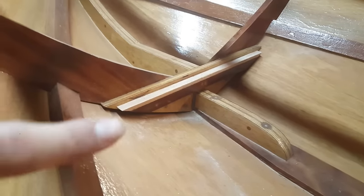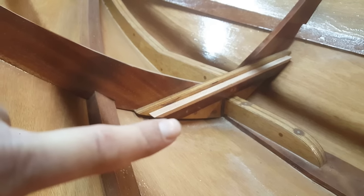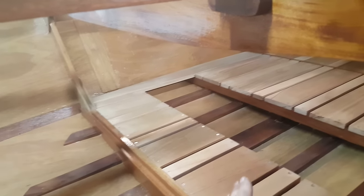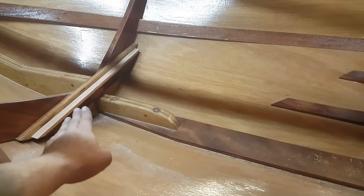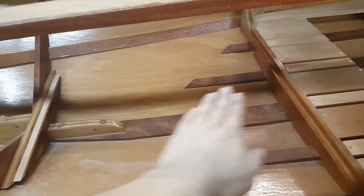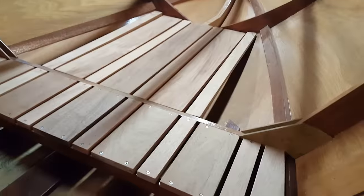This is my floor timber at frame five and a half. You can see the extra piece of darker mahogany that I put on it, set 13/16 deep from the top. When I laid my straight edge on top of the planks back here — touching these planks and extending up to the front — there was about a 3/8-inch gap underneath, meaning I needed to raise this 3/8 of an inch to be perfectly flush. So this light strip on top of my dark strip is 3/8 of an inch tall, just extending it up to match flush. We're getting ready to start cutting the forward planks.